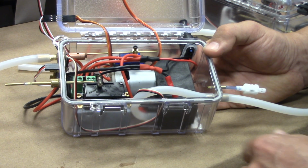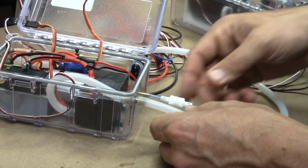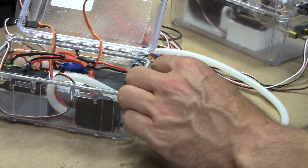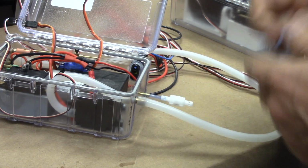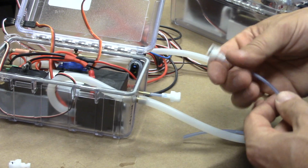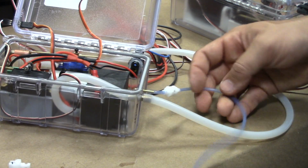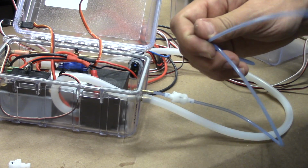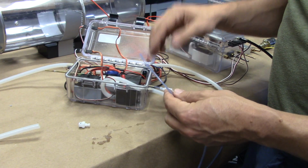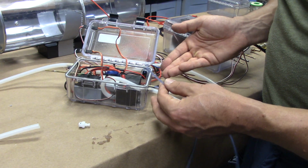And that is it. The other thing that I'm going to mention here is on the back, and this is a quick connect, and what it allows you to do is replace this plug, which is currently on there right now. It's just a plug that stops anything from getting in or out. You can attach a hose. Now, the hose actually serves two purposes. And the first one is that you can close up the module, throw it under the water, blow into the end, and you can check for leaks.